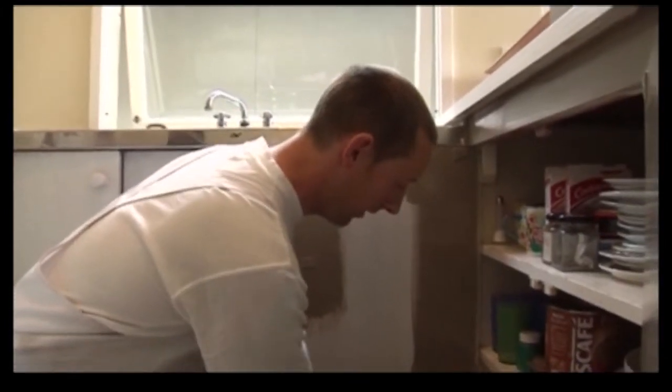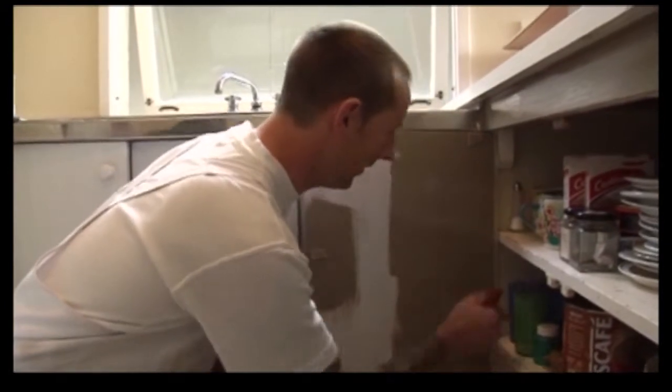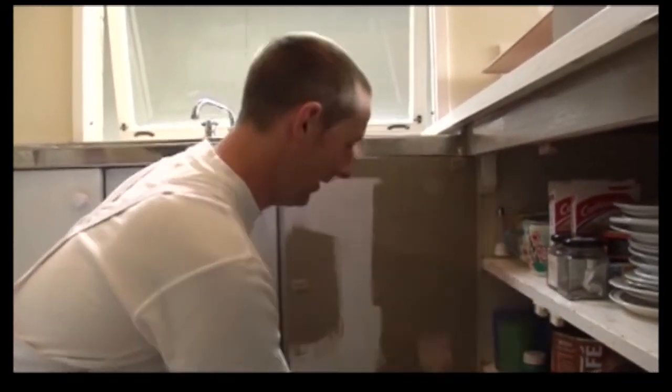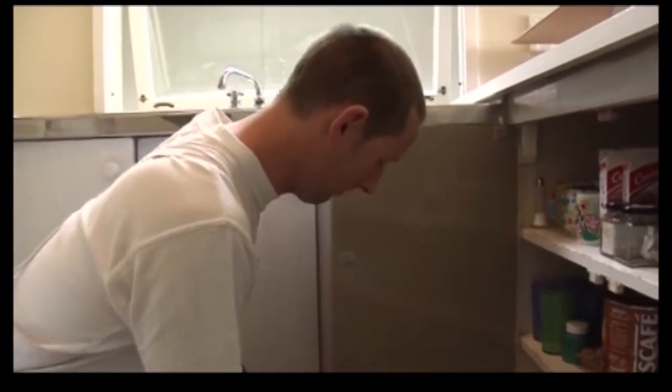What about following trends in the kitchen? The colours on the cupboards themselves are the main ones, but trend-wise you can always put a nice splashback around the kitchen — it can work quite well. Do colour schemes change for larger and smaller kitchens? They certainly do. Depends if you've got overhead cupboards, which can divide a room — if they can be easily removed, it's ideal. If you're doing up a kitchen on a budget, you can tie in a living area and dining area for lots of space. Doing the kitchen cupboards, we sand them down, give them a coat of acrylic primer undercoat, and they'll have two top coats of water-based enamel, which is pretty hardy and should withstand all the opening and shutting of doors and any spillages.